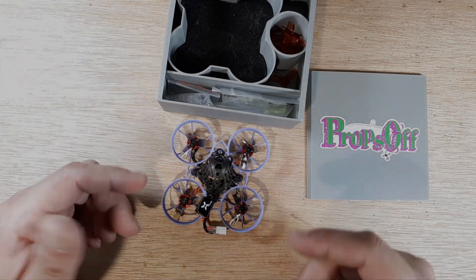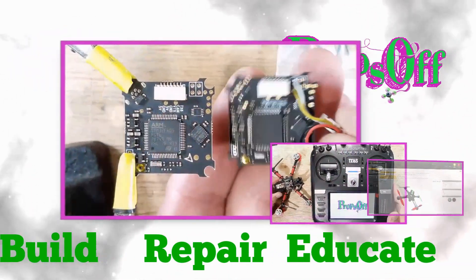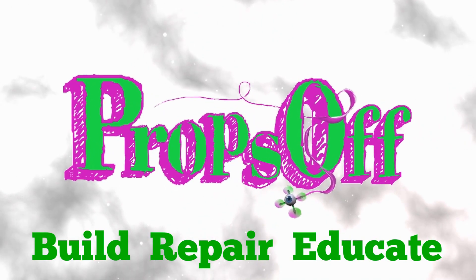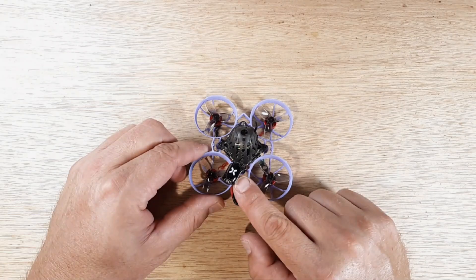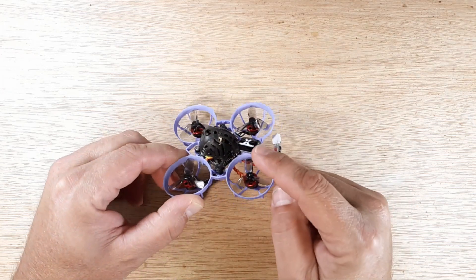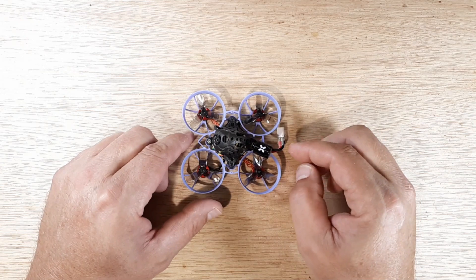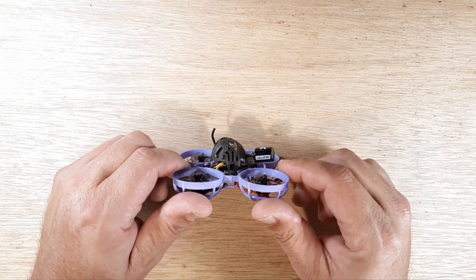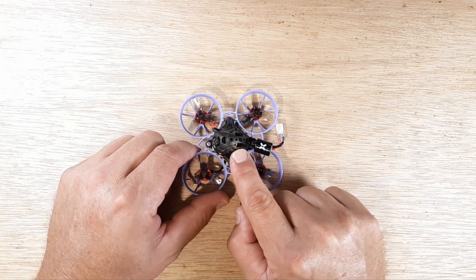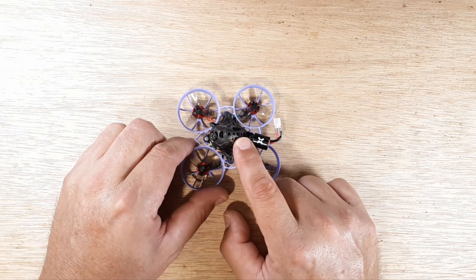So that's what this video is about - stay tuned, let's get started. I've soldered a UFL connector on the front of this quad and put a right-hand polarized antenna on it. The reason I had to do that is the United States Air Force Museum race required right or left-hand polarization for the VTX output, so all my quads now have a right-hand polarized antenna. The Reaper Nano VTX has a UFL built onto it, so you don't have to worry about soldering your own into the board.